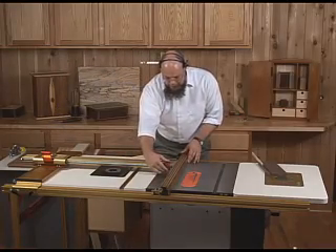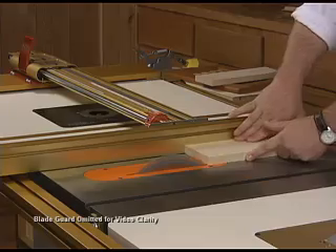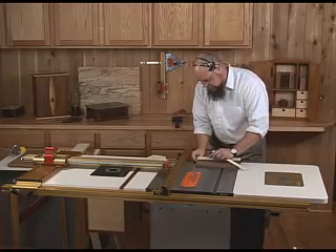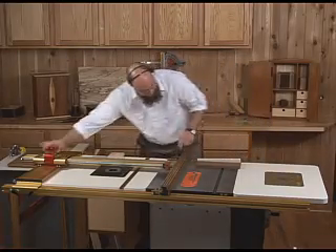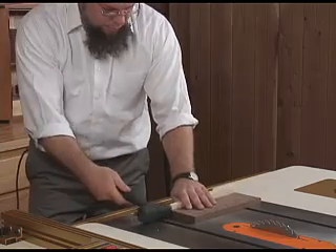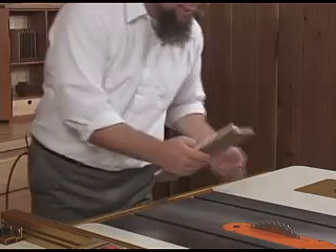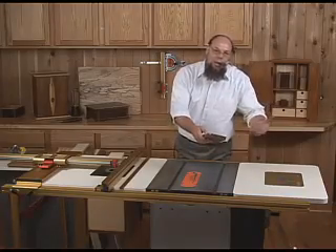We'll use that same technique one more time — cut another piece just a hair bigger than that three-sixteenths slot. And as I promised, we're not going to wait for the glue to dry to assemble all this; we've got a little bit more efficient method we use during the demos. Parts go in easily, go all the way to the bottom of the slot, and there's no way for them to come out as we surface that.